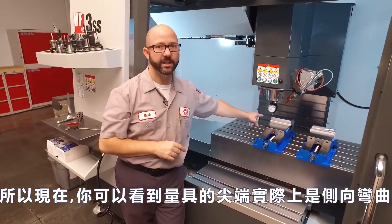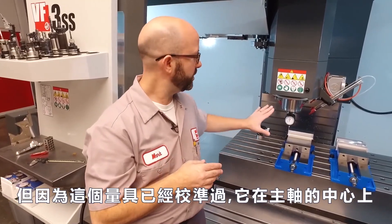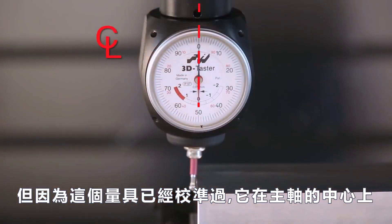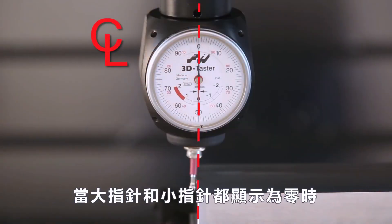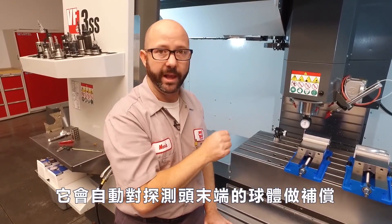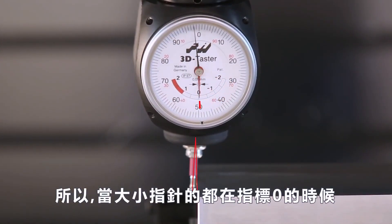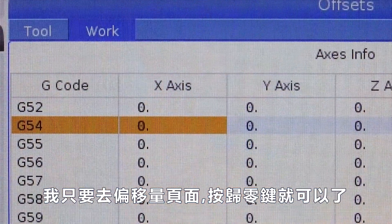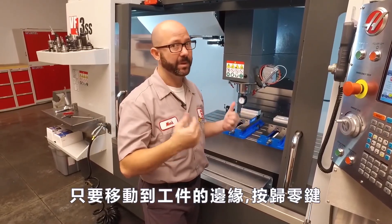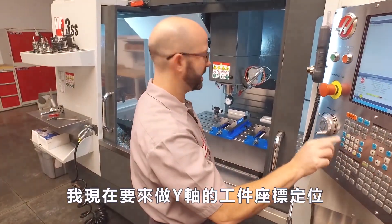You can see that the indicator tip is actually bent sideways. What's happened is this indicator was already calibrated to put the centerline of our spindle right above the edge of our part when both the large and small dials read zero — it's compensating for the ball at the end of that stylus. So with this indicator at zero-zero, all I have to do is go to my offset page and press part zero set. We're done. Just jog up against the edge of a part and press part zero set. Now I'll go ahead and move it back and set my Y.